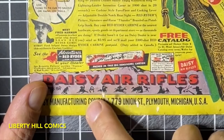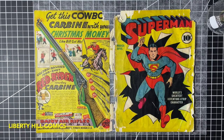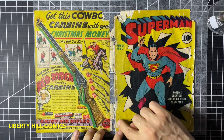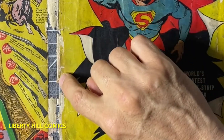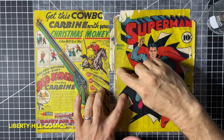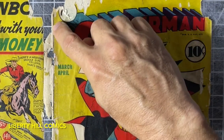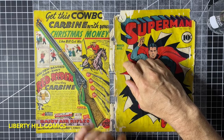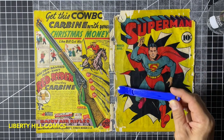In contrast to the areas I just showed you, let me show you the areas where there still is some adhesive — you can hear it and you can feel it, it's still tacky right here. So we need to work on this area. If you use incident light — my light source is over here — you can actually see on the surface where that tackiness is. Another area is still a little bit tacky, and this strip is tacky. I think it's enough that we want to wet it and use this scraper tool to remove some of that adhesive.